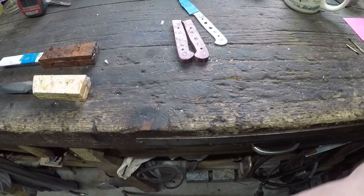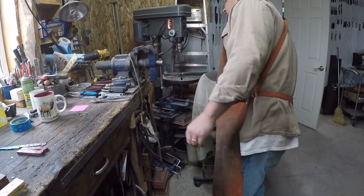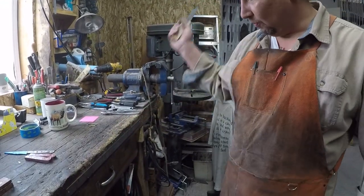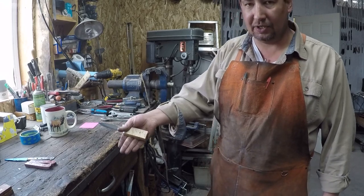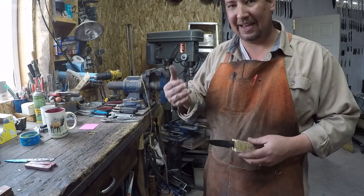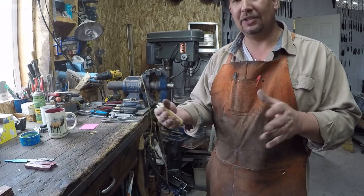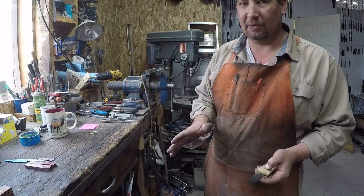So you take a sword or something, right? I mean, I don't think I have any choppers right here right now. But anyway, if you have a chopper and you're sitting there chopping with it, well, every time that blade hits that wood, the blade's going to sink into it a little bit, which kind of eases the vibration and the stress. But still, you're going to get a shock, right? And that shock is going to get transmitted to a handle. All right, which is why that G-Flex works so amazingly well, because it is very strong, but yet it's got just a little bit of give, and it'll take that kind of abuse, or actually just use, if that's what you design it for, whereas this type of epoxy won't.